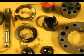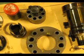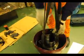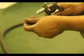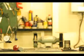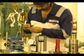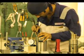When the fuel pump is completely overhauled, keep parts in diesel for cleaning followed by a good blow of air and inspection of internal parts. With the help of a dial gauge, check the bearing clearance while the roller is moved up and down. Measure the tappet clearance — it should not be more than 0.25 mm.